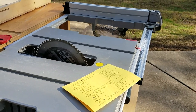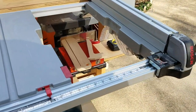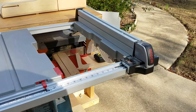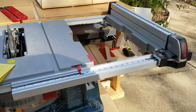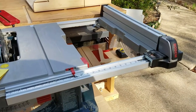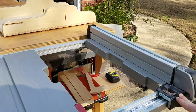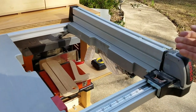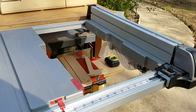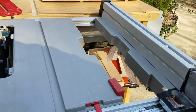The DeWalt has a rack-and-pinion type fence; this one has the smooth glide fence. I just felt I was interfacing with this saw much like I would a cabinet saw, which is why I preferred it. The stand quality on the Bosch out of the box was much better — the DeWalt I looked at just had a scissor stand, while this one had a rolling stand, at a direct cost comparison. I think DeWalt has corrected that since. At the extended position, I don't think the 744 had any material support; I see DeWalt has a flip-over support on their saws now, and I think they're beating the Bosch on rip capacity — but that's also with that rack-and-pinion sliding fence.